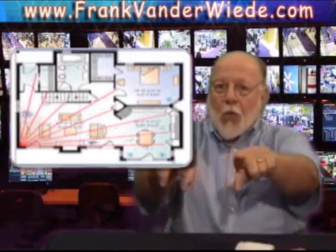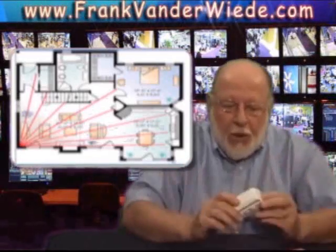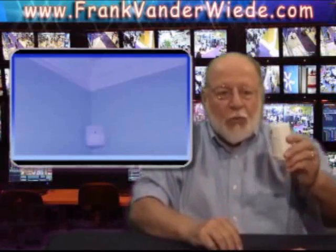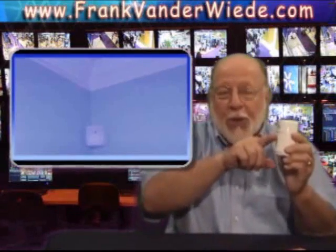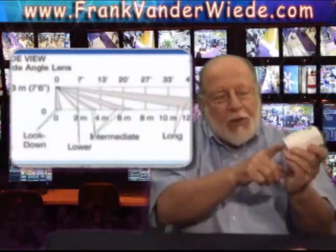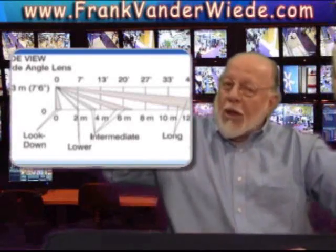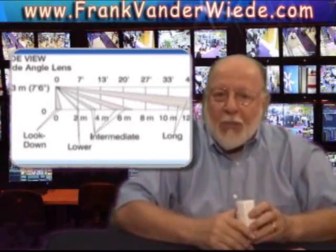Theoretically, you could walk up some distance because the further from the detector, the wider the beams become. These are made to be mounted seven feet off the floor — it'll give you the optimum reach. They shouldn't be tilted. It'll put beams out: one very far, one medium beam, and one down. And some detectors will broadcast straight down — those can be mounted even over a door, catching somebody coming in the door and out in the room at the same time.